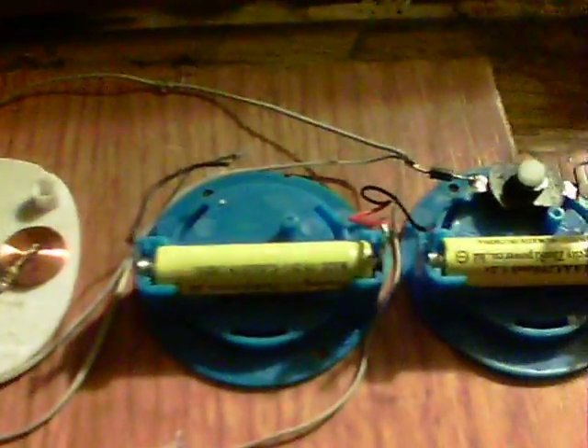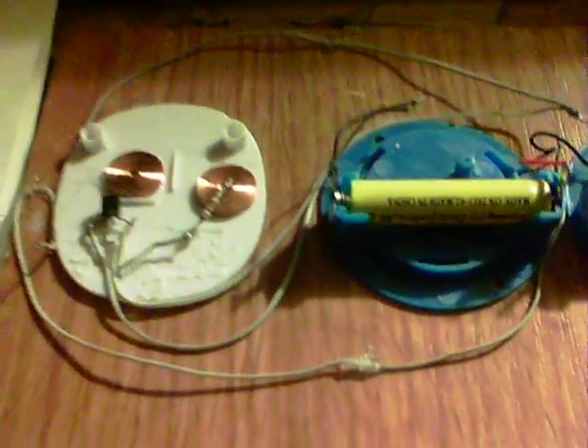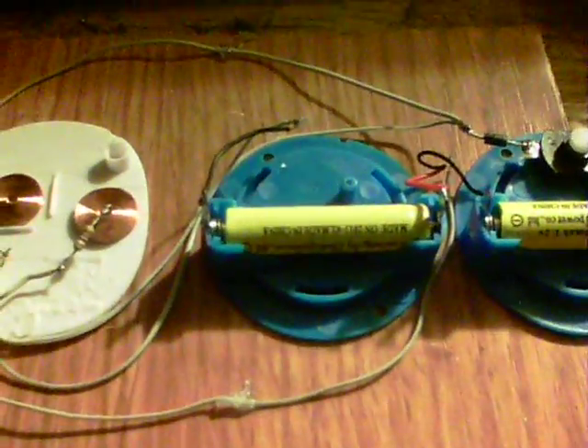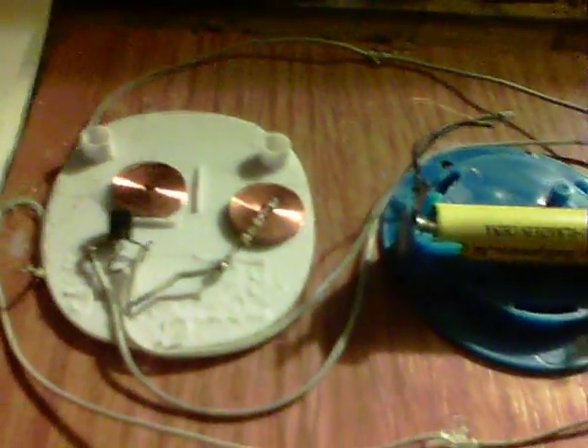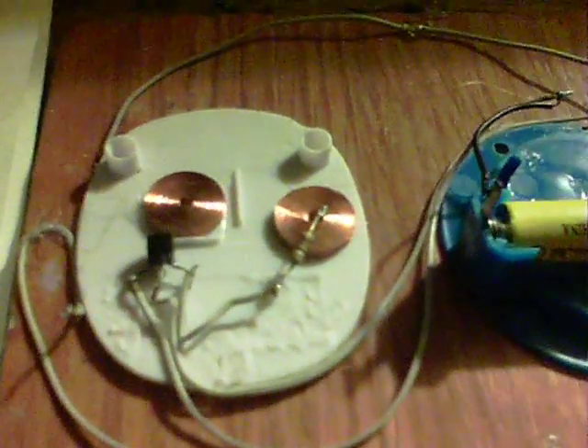Over the past day or so the problem was the light went out and yet it still carried on. I think it's to do with the wire — I found out that if I move them around closer or further away, the light output intensity changed. Also if I touch the resistor, which in this case is a 100 ohm, this one uses a C3198 and it's the GR flavour of that.